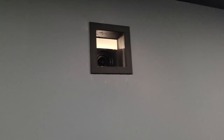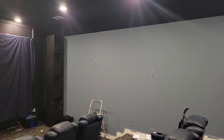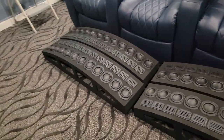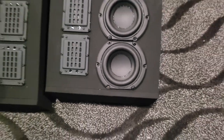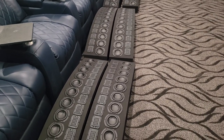They came through. You can kind of see the projector right there — it still needs some adjustment, it's sitting kind of low. I've not put the anamorphic lens in yet. I pulled the wires out here for the side surrounds because they're probably going to do the spray foam for the sides and the ceiling while I'm in Germany — two inches of closed cell spray foam, which will make everything a lot more rigid. Down here we have the side surround speakers, six of them. They look done but they're really not because the wiring hasn't been done yet. Plus I forgot these use six screws per driver so I didn't order enough screws, but I ordered more and they came in today. Possibly tonight I'll put in the rest of them — about a hundred screws — or I may just wait till I get back.